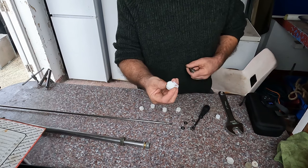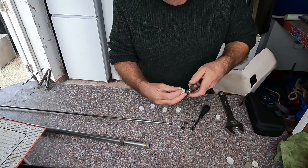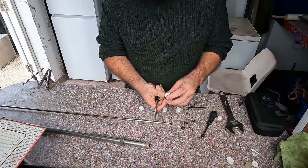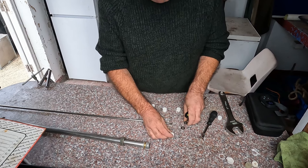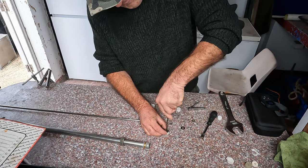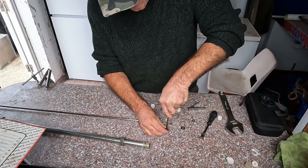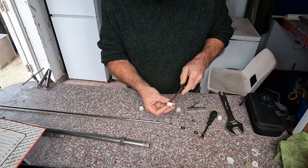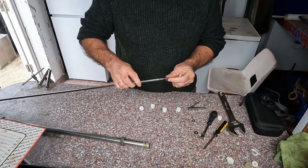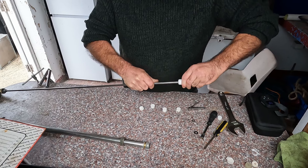This is one of the silicone seals that I made in one of my previous videos and we're going to clean this up as I showed you before with the nail clippers. So now we've trimmed the seal up and it is taking some sort of shape. As I showed you before, you just put a washer over the top, use a screwdriver — you'll hear that pop — turn it over the other way and it should just go straight through like that. Then put your washer on and slide your new seal on like so.